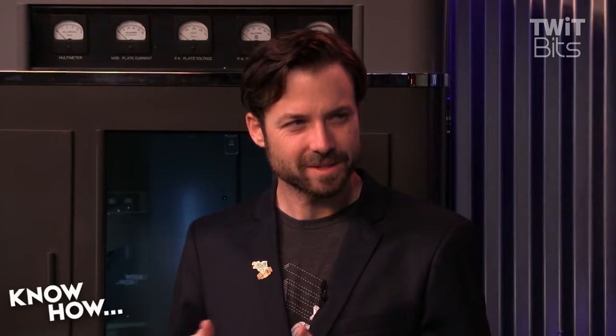We were going to set it up in your dad's garage, right? Like a proximity sensor. Precisely. The whole idea was to use a little ultrasonic sensor — a 99 cent ultrasonic sensor combined with a $2 Arduino and a strip of WS2812 LEDs. It gave him a status report: as he got closer, there were fewer lights and they started to turn red until it was one light red, meaning no more room, stop. You're up against the wall now.